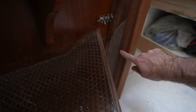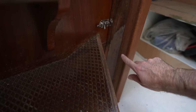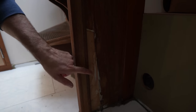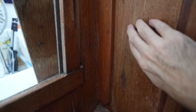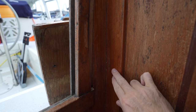There's a repair I made here that's butting up against some of the trim that needs to be varnished, and we actually need to finish that repair with a little bit of fairing compound before we can varnish. The other side of that repair also needs some attention before it's ready for varnish and paint. And before we can do anything, we also need to remove all this old partially failed varnish from both the areas that are going to get painted and the areas that are going to get varnished.